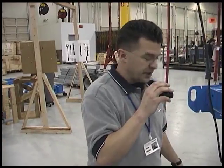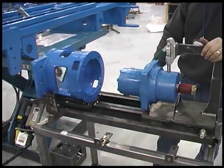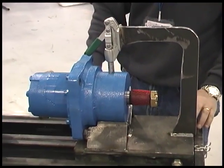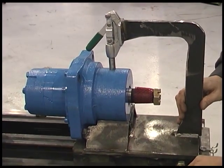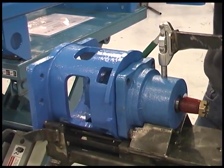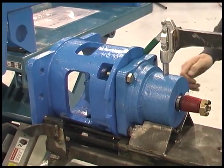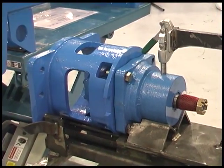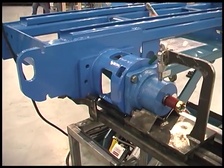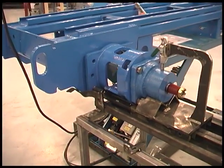One of the installation tools that we designed and built during the event was for our rear hub assembly. As you can see here, the brake motor is assembled in the saddle. The fittings are put on while you're held down in location. And then as that brake motor is completed, the pin is released, slid forward, self-aligns and locates itself into the hub assembly, at which point the 4 bolts are put in, still on your assembly tool, line side, and then upon installation, the cart slides in. It's got self-aligning flanges here that'll help you guide in, align your 4 holes, which in turn you put the 6 bolt holes into the chassis, and that hub assembly is installed.